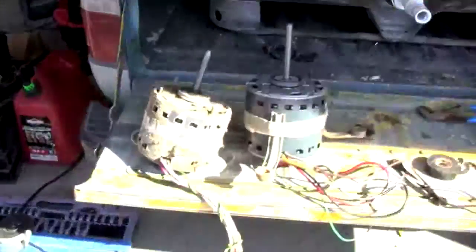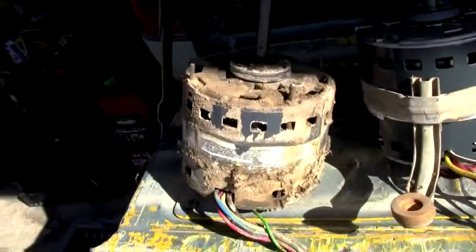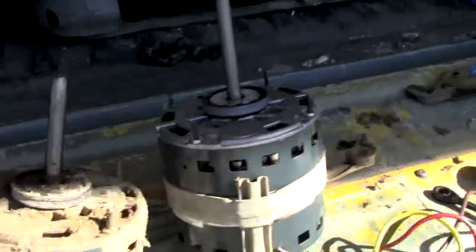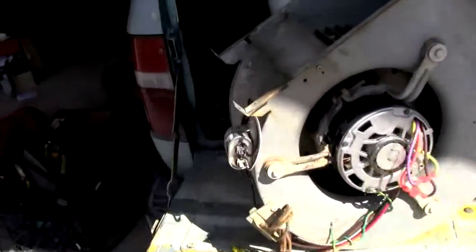That affects the volume of air going through the system. I've replaced the motor on this blower unit, and you can see the old motor was completely wet and improperly filtered. This HVAC system had a one-third horsepower motor, so I'm putting in a half horsepower motor to give it a little more torque and get that blower turning just a little bit faster. We've got our new part and the blower itself nice and clean.